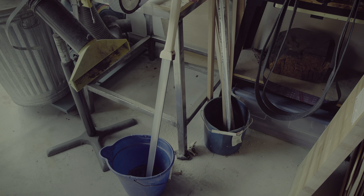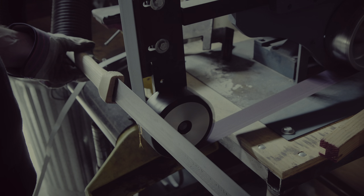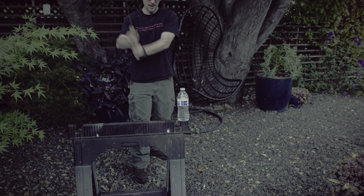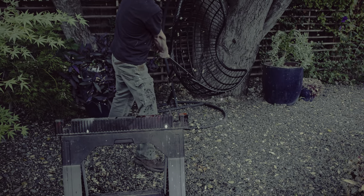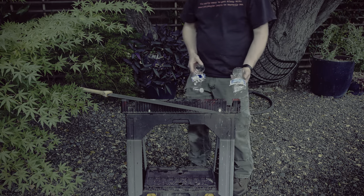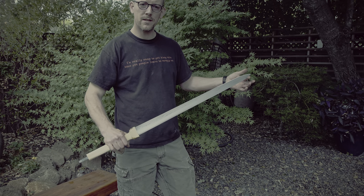To test the blade, I decided to put a temporary handle on it. I will not keep this for myself since it is a present to a friend who will create and put on his own fittings. To sharpen the blade, I grind in a secondary bevel on the slack belt. I was not quite sure how to test the blade and was also a little worried that the friction fit of the handle might come off — the garden water bottles seemed like a reasonable option. It's important to align the blade with your cutting angle. The bottles are destroyed now and perhaps not the best cutting exercise object, but the sword felt fine and the impact on hitting seemed okay as well.